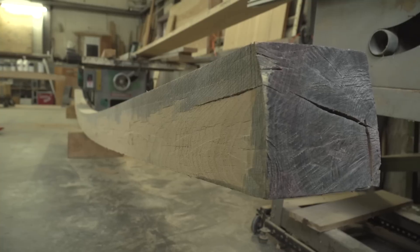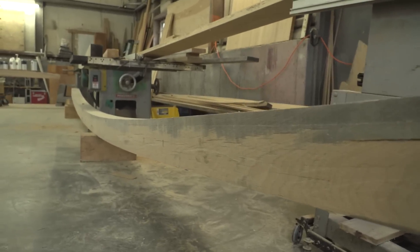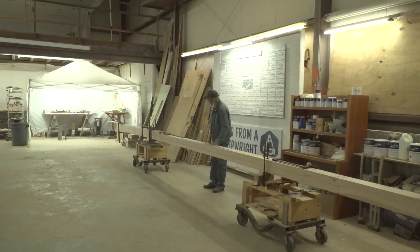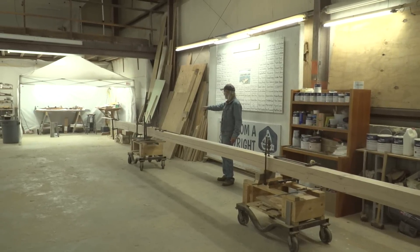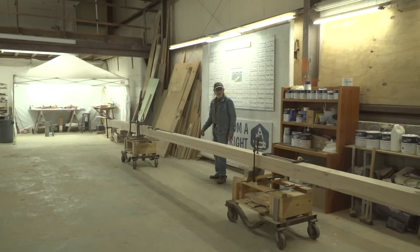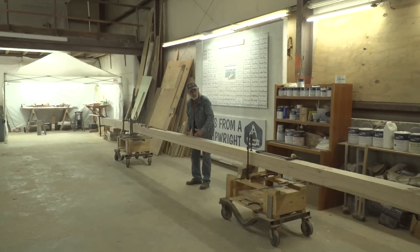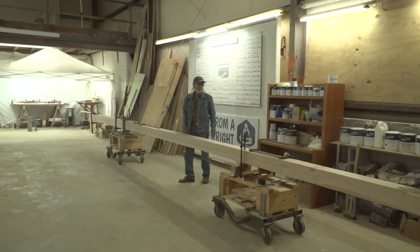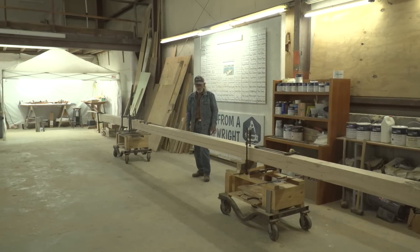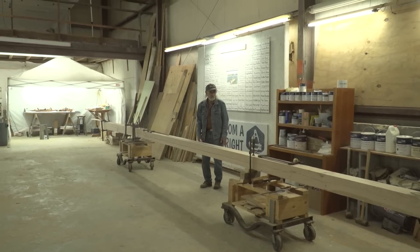This stuff is Quercus alba — it's white oak, believe me, and it's solid. Here's our keel right here. I've joined that piece on it aft there, but I'm going to remove that because when I cut the scarf up here, I'm going to roll it on its side one way and cut one side, then roll it on the side the other way — doing that quite a few times, and maybe when I'm cutting the rabbet as well.